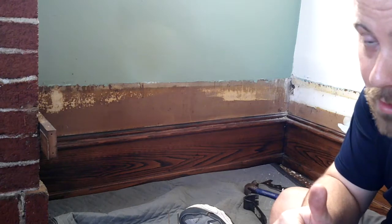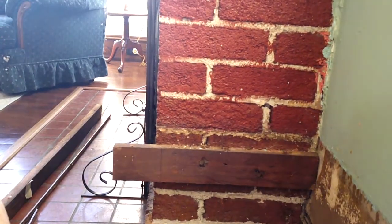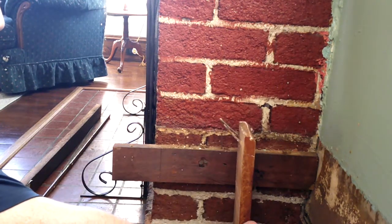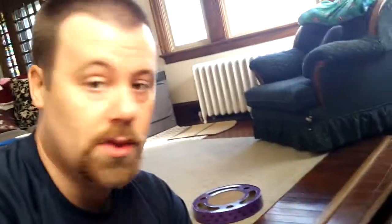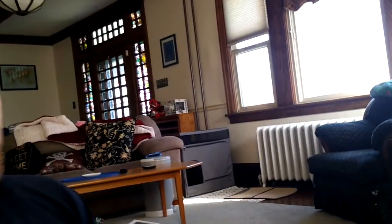Really wanted to mention that — I'm not touching the baseboard. Now, I'm extremely nervous about this one because I don't know how they anchored this into the brick. It looks like they drove it right into a mortar joint. Change of plan — this fireplace has a little jut-out right here that I'm going to have to account for when I build the cabinet. I want it as tight as possible, so I'm actually going to bring in a little saw and just cut this back enough so it acts as a spacer for my cabinet. I don't want to do anything to mess with this fireplace — it's very old and it's the centerpiece of the house.